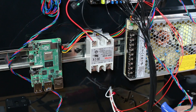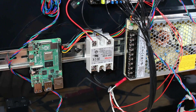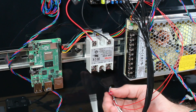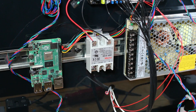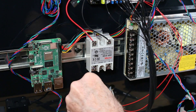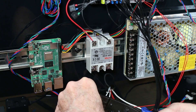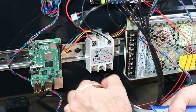I've taken the thermal fuse — the ends are already pre-stripped — and I'm adding a barrel connector. I've also trimmed the wire coming from the bed, which I'll connect right here. This will allow one side of the electricity going into the plate to be protected by that fuse. If the fuse breaks, the plate shuts off. I'm connecting one end of that fuse to the SSR relay, so 110V will drive right through that to the heat plate.